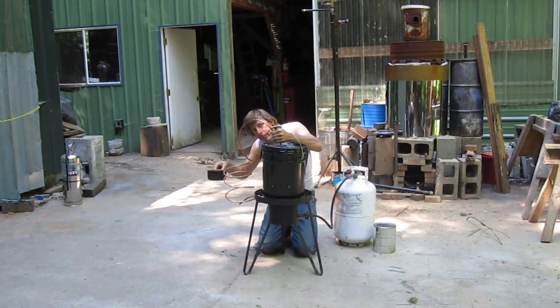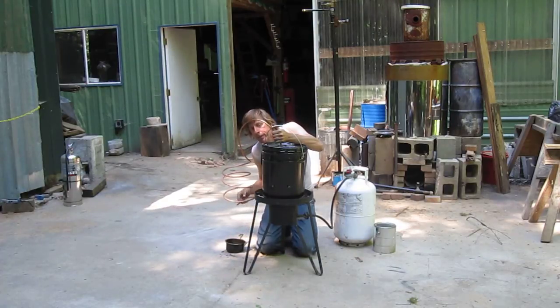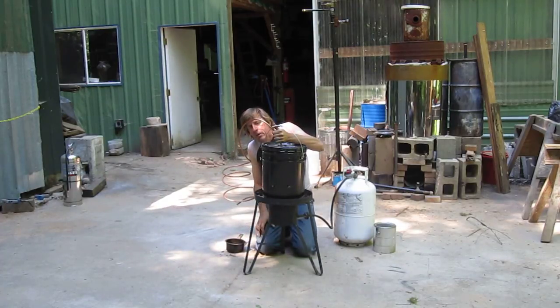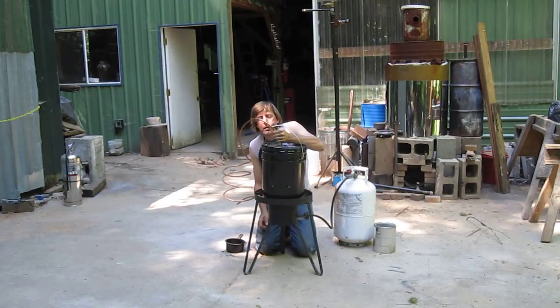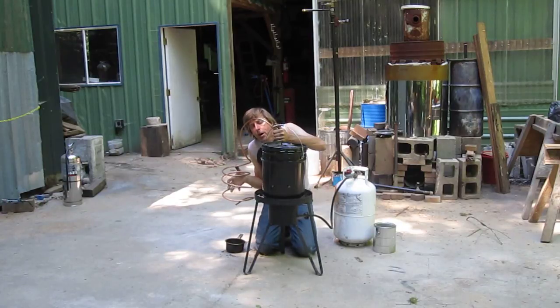And this is a pan to collect the condensate, which is going to be the wood gases and other byproducts of cellular metabolism — wood vinegar, methanol in the case of wood — or if you're turning plastic into oil, it's going to be the actual condensed oil.